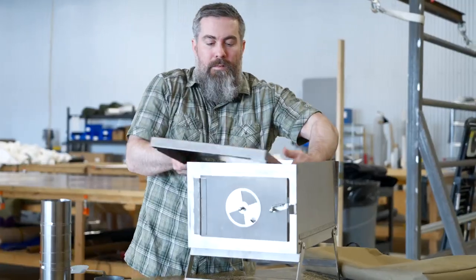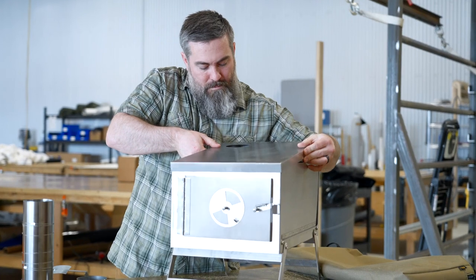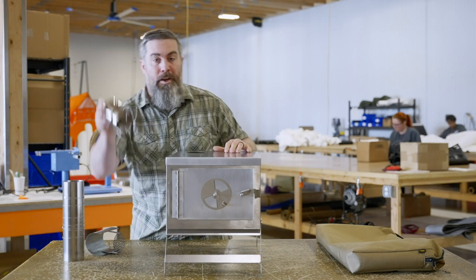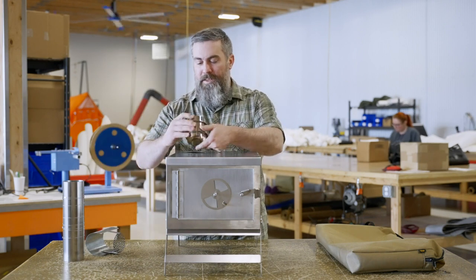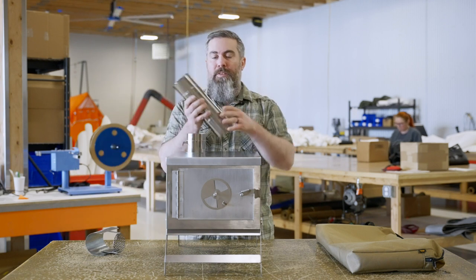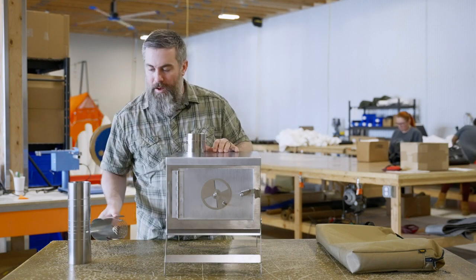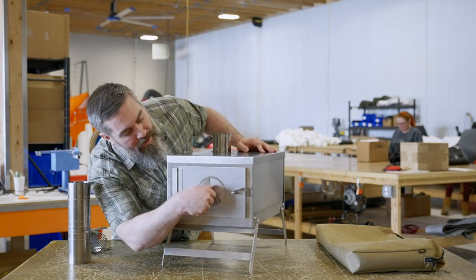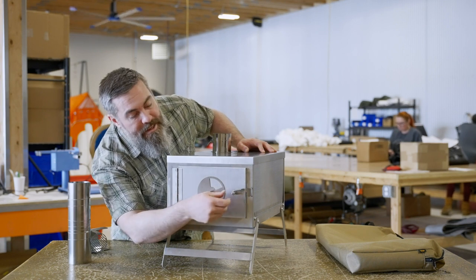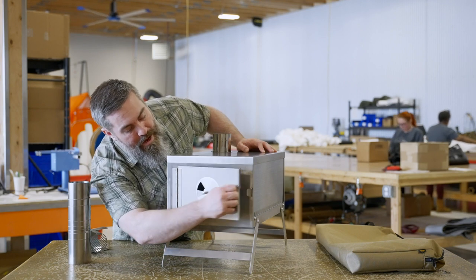Then take your top and attach it. You'd put your damper on top of the stove, and then when you have your piping rolled up to the long width, you can get that installed. Then you would install your spark arrester. On the front there's a spring-loaded handle — really easy to use, holds the stove tight. You also have another dampening capability on the front, so you have your front damper as well.